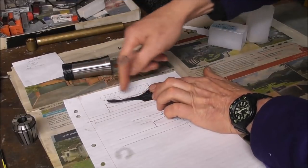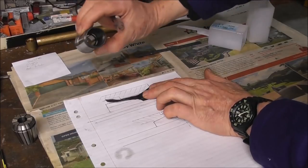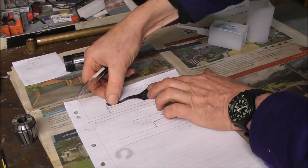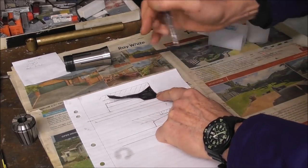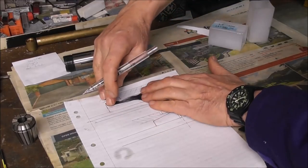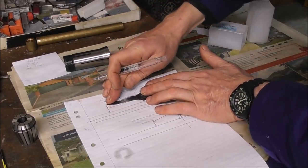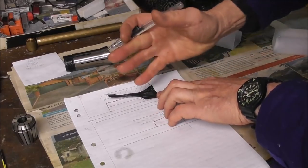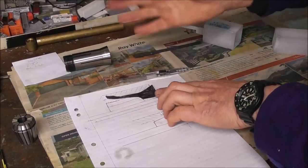This is a sectional view of the collet. It buckles in the middle here because it's thinned out here. There's quite a big hole inside the collet on all the different sizes. Maybe that's to allow it to buckle. So then it applies itself parallel to a smaller diameter and actually holds really well, because each leaf section of the collet spring is buckling here, exaggerated like that, until you get really good conformation and locking, and maybe the 5C system is good. How can I test it to see whether it does or not?